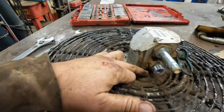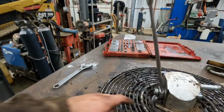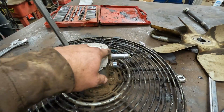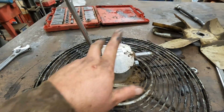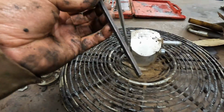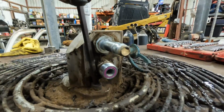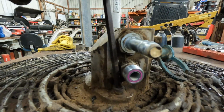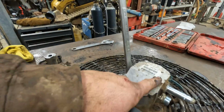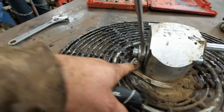Yeah, let's go ahead and get these two Allen bolts out real quick. All right, well, I have come to discover that they really do not want you to take these Allen bolts out without removing all of this stuff that's up top. So I'm gonna go ahead and clean this up real good because I'm gonna have to take this fitting off, that fitting off, because it's a 5/16 Allen head that fits in there. And as you guys can tell, it's at a pretty steep angle, and I do not want to strip that out. So we're gonna go ahead and get this cleaned off. Then I gotta take all these fittings off so we can get like a nice straight shot down there, so we can get that bolt out and that bolt out.